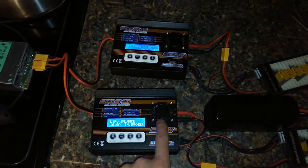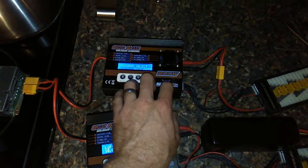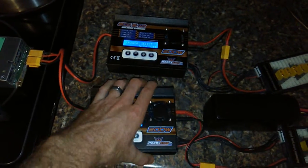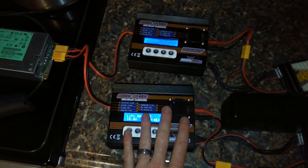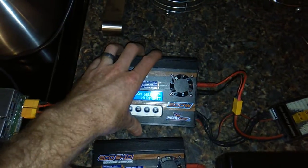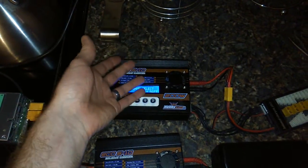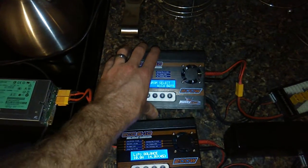This one I actually modified to force the fan on all the time. This one is all stock. Now, this one will actually cool down to a manageable state again shortly. So if it does start overheating, you shut it off, let it cool down, and go. But this one — they don't have a thermal control on it when it's off. So if it's not charging, it just sits there and will slowly cook itself, because it's not dissipating any heat. And they'll just destroy themselves.